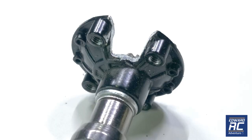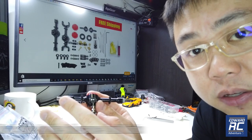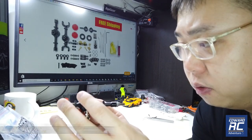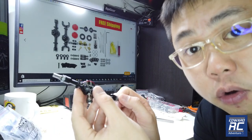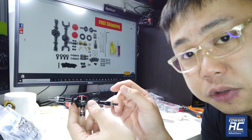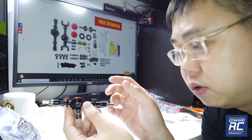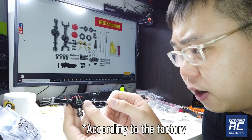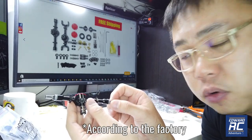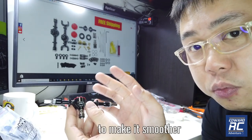I have actually cut up the input cover here so I can see what's going on with the meshing inside. But it may be the same or different in your case — you'll actually have to adjust it accordingly. After I've added shims and made some adjustments, it sounded like the meshing of the brass gear, so that it's correct. You want a little bit of binding so that you can break it in to make it even smoother.